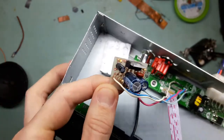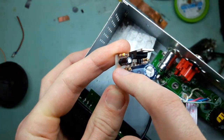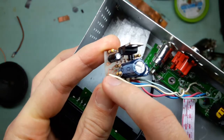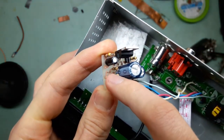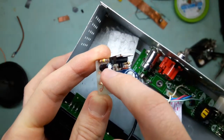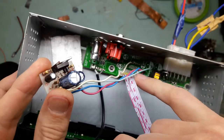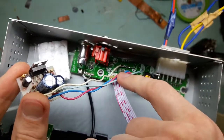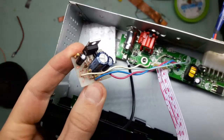I'm not sure yet. There are some holes which ain't gonna be used, like this one. That's a signal ground. That's obviously the signal. Where you see the jumper link there, there should be another capacitor like this, input capacitor, but that does not make sense because there are AC coupling caps on the board, those little 0603 ceramic chip capacitors.